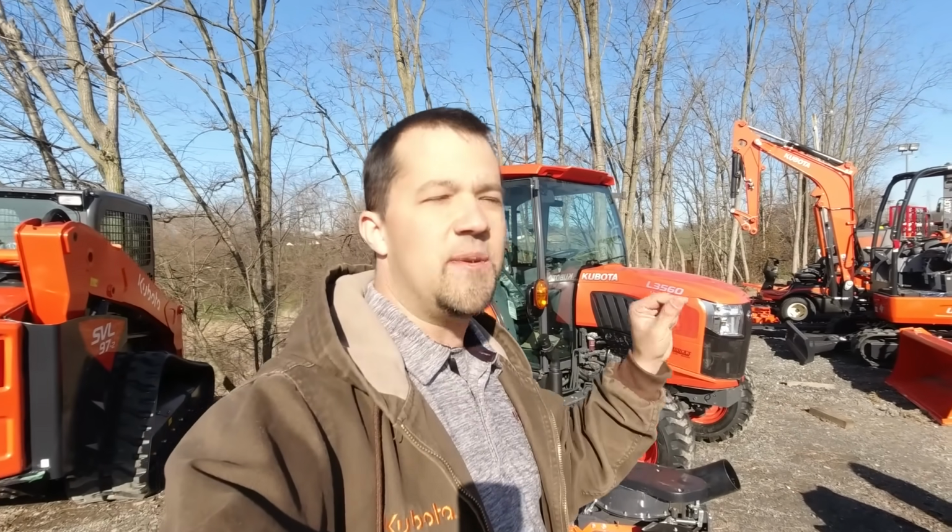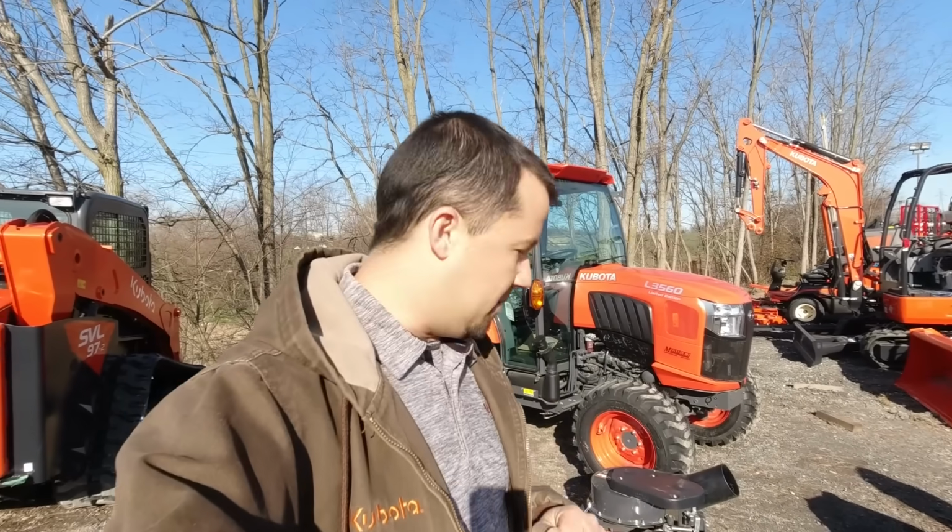But you do want to be really cautious. Even within the same product family, you will see times that you have attachments that don't carry back and forth between models. So be cautious of that. And usually it's small things. It's going to be mounting tabs and that kind of stuff that if you've got a welder, you probably can overcome by moving some stuff around, but certainly is not going to be plug and play in many, many instances. You could probably guess to this point that this doesn't get any easier as you get into more unique implements. The things that go onto the front of a tractor, your front blades, front snowblowers, front brooms, the stuff that mounts onto the belly of the machine is perhaps the most specific of all of these things.